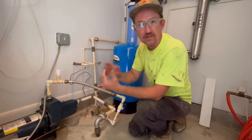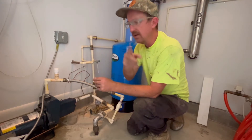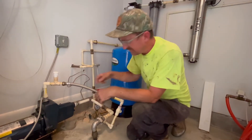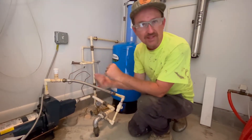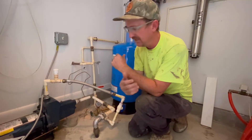Those are the most likely places for a leak to occur. In this case, sure enough, the check valve had actually separated from the intake pipe, which caused this pump to continually run as water was being ejected back out the suction line into the tank — it was just blowing all the excess water pressure back into the cistern.